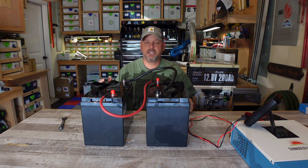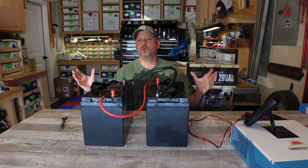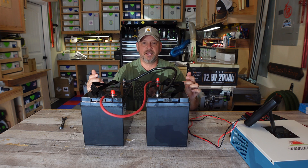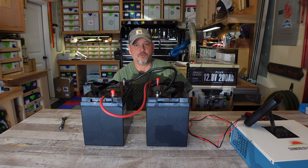The other main reason is that using a solar charge controller — in my case a Victron — I can get almost double the amount of watts being input into my solar charge controller on a 24 volt system versus a 12 volt system. So I can use more solar panels to charge up my battery on a 24 volt system than I could on a 12 volt system. Those are my main two reasons: smaller cables, and more watts being input from solar into your charge controller on a 24 volt system.